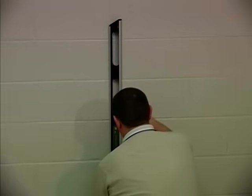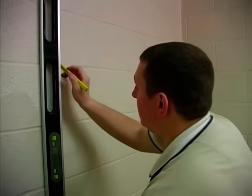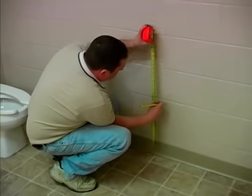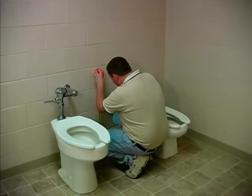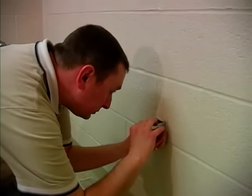Using a level, mark the walls using a center line of the panels and the center line of the wall pilaster. Measure up the walls and mark the center line locations of brackets on the lines just made. See elevation for bracket heights. Use brackets as a template to mark where the holes need to be drilled.